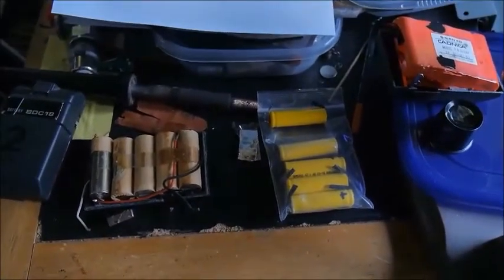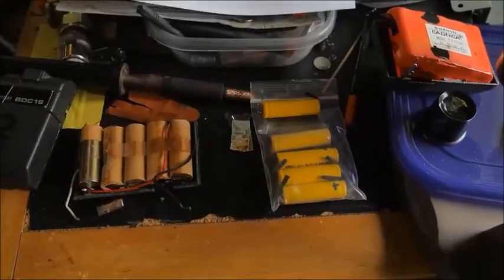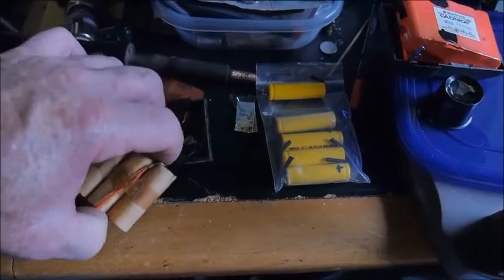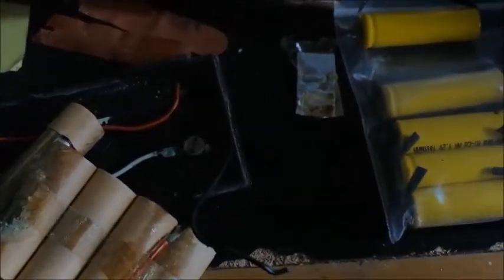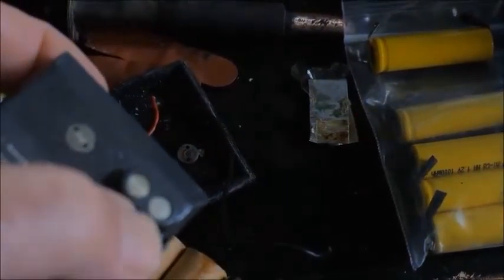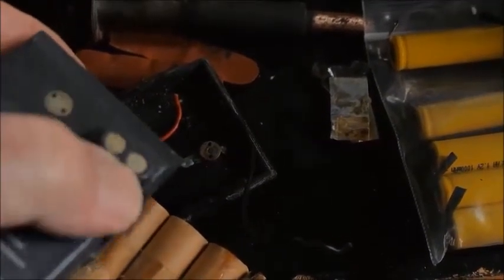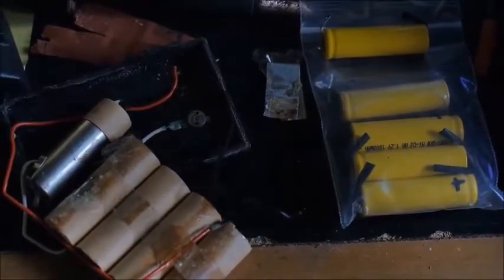I've laid out my configuration of how it is, and I still have the battery pack somewhat intact so I can follow that. It's pretty simple. The hardest part is making sure that these connectors down in here are still usable - there are little pins made into the plastic of the battery where it comes through to the back. This is where the charger attaches, and this is the pin for the thermistor where it cuts off the flow if the heat gets too much. I'm going to get busy putting this battery pack together and then come back and show you what it looks like.